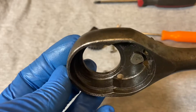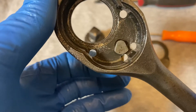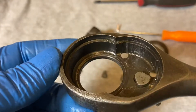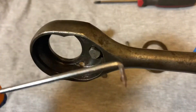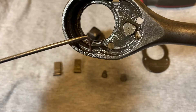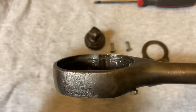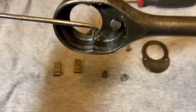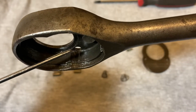This is what the mechanism housing looks like. It has the switch — the pendulum switch goes back and forth and switches the pawls. There's the groove here for the plate, where the plate sits. There's a small cutout here for the screw on both sides.